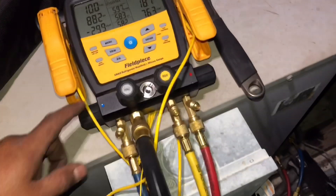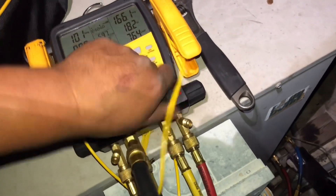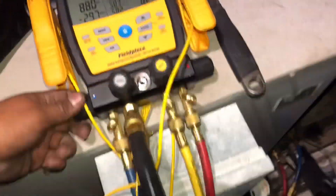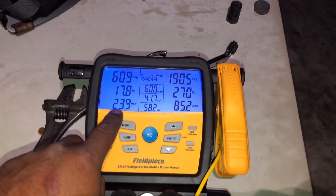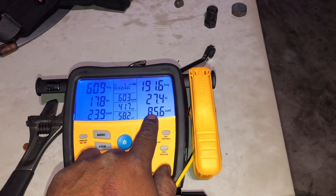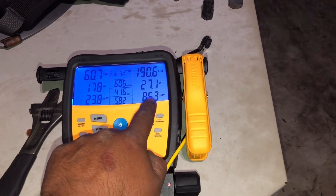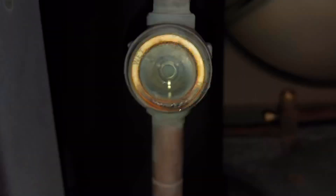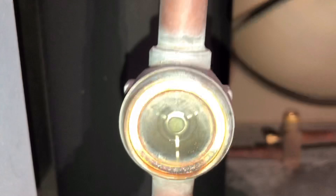Got a jug. My bad — that shows you how much I haven't used my four-port manifold. Gotta open this up first. There we go, now we can start adding some gas. We're looking a lot better: 23-degree evaporator coil, about 180-190 PSI, about 85°F saturation. We're at about 60 degrees so that's not too bad, but we're still flashing a little bit. Looking really good — I'm gonna add a little more.